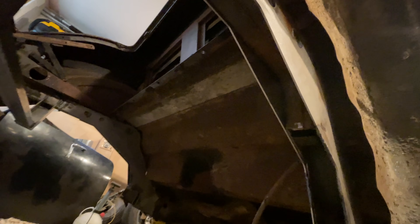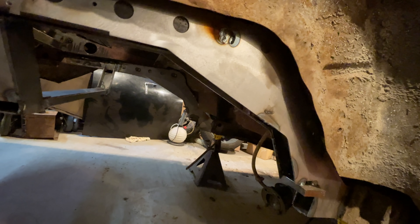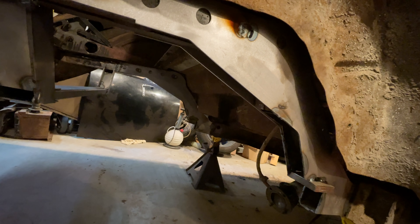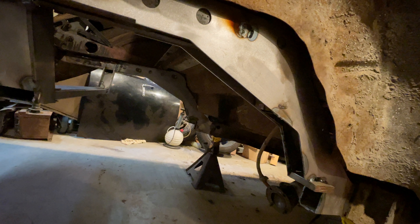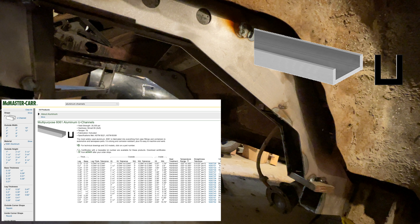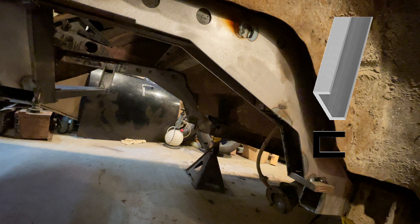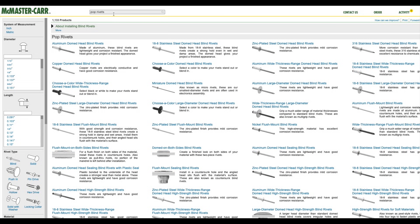I gave a few good welds — or we'll call them acceptable welds. I need to close this section off and also the part on the top as well, because it doesn't have much strength in compression — it'll just buckle. Buckling's one of those things that separates the engineers from the engineering students. You can do an analysis, but it might not tell you that this part will crunch up like an accordion. I don't want to weld on this plate because I'm a little worried these pockets are going to be magnets for corrosion — I wanted to make sure I could get access for a good clean and powder coating. So I'm probably just going to come back and rivet on some aluminum U-channel. U-channel is like C-channel but it's sideways. The top will use N-channel, which is like U-channel except it's upside down. I'll use some coated rivets so I don't have to worry about dissimilar metal corrosion.